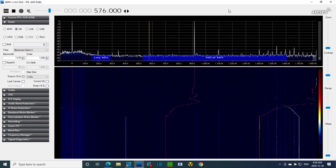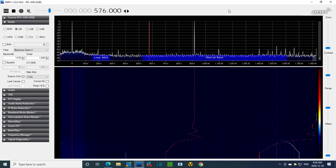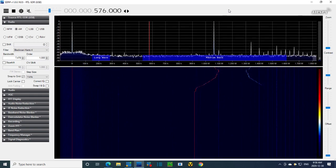So, local oscillator 900. It's picking up a signal at a million. That's roughly 75 kilohertz away. Let's go above. So this radio is completely image sensitive, I guess would be the word. So this radio is liable to pick up a lot of stuff over and over.